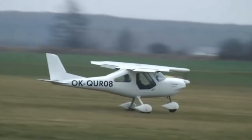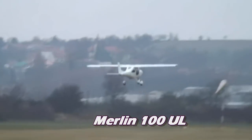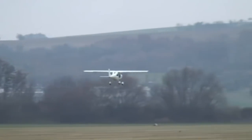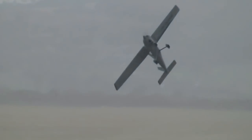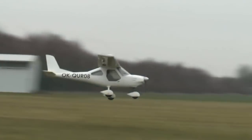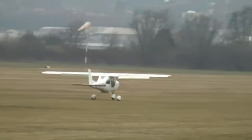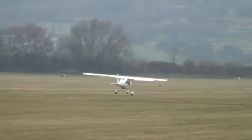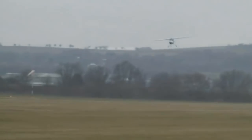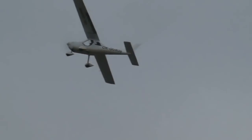We're developing two other aircraft with much less drag — still very light single-seaters, low frontal area, clean airframes. With the same power, instead of 30 mph they'll go 90 mph. We talked about this at the German Aero Show just a week ago, and I'm familiar with one called the Merlin — a nice little airplane. The plan is to put a two-stroke on it first, then offer electric. Those aircraft require 30 to 40 horsepower to take off, then fly at 20 horsepower. And they can carry twice the battery, so they'll be going 80 to 100 miles an hour with range.